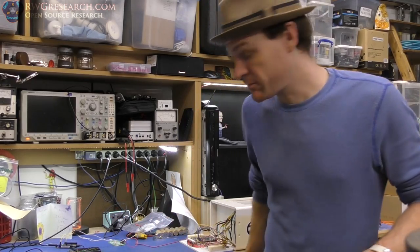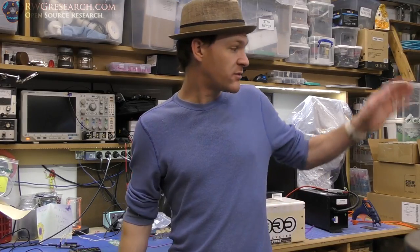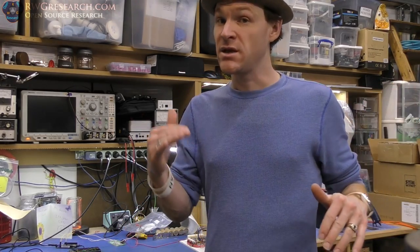Anyway, other than that, this is turning out to be a really sweet project. So I'm going to be 3D printing a mount for the phone over there, getting that finished up, and slapping it on there, and then while I'm doing some testing, I'll figure out how to actually do the hardware and the software to remap the throttle control to do different things like efficiency mode or all-out mode or a nice gradual ramp or even minimum speeds.